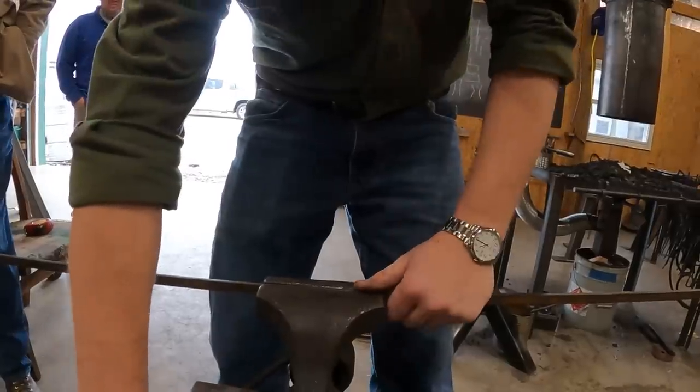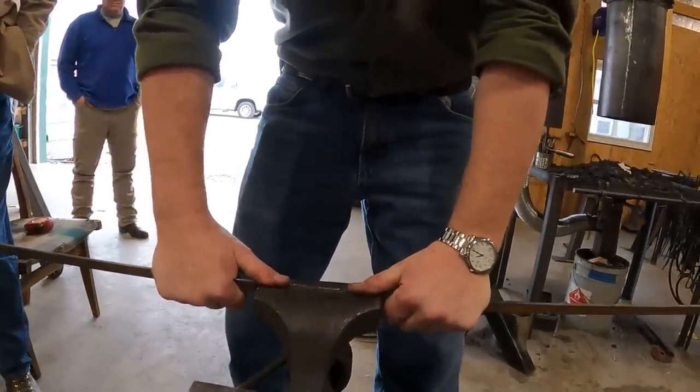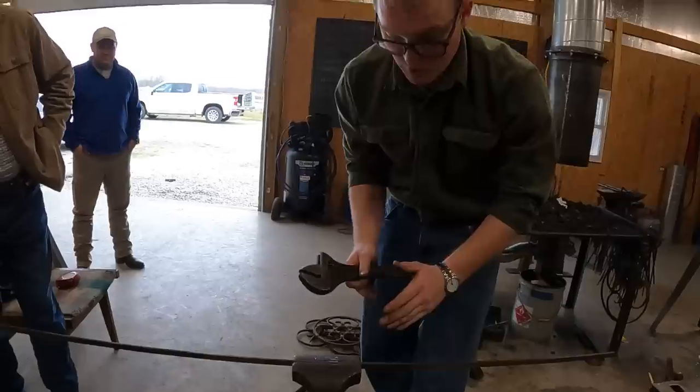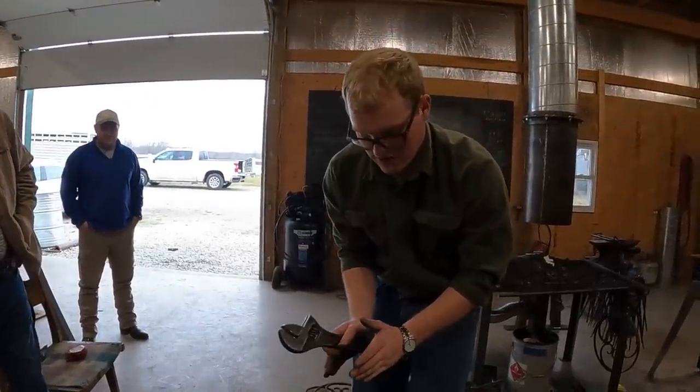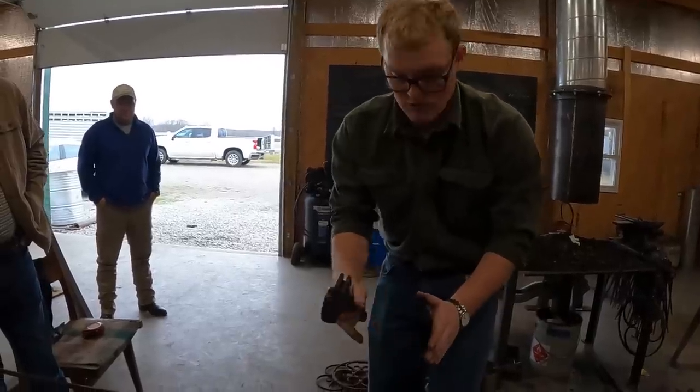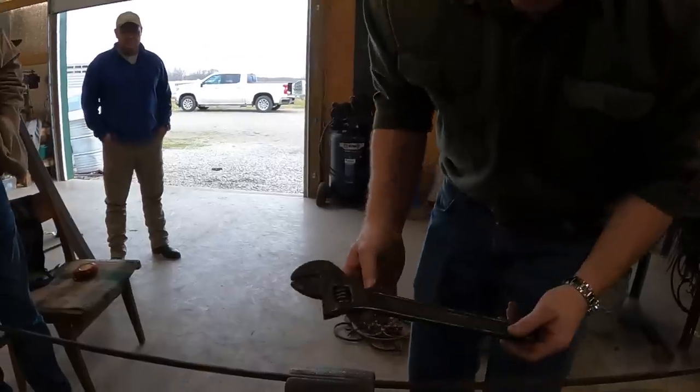One thing I want to make right is that it's relatively even, so I can do a little bit of adjustment here. So it's a square break. That's right. Because when you forge that end of the material out, you don't want it to veer off one side or the other. Instead, it'll be that nice round in the center. Then I'm just taking a crescent wrench.